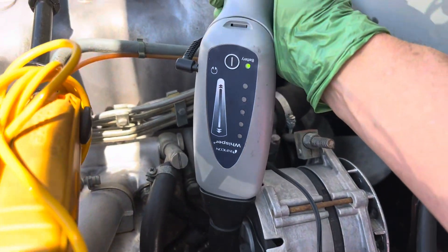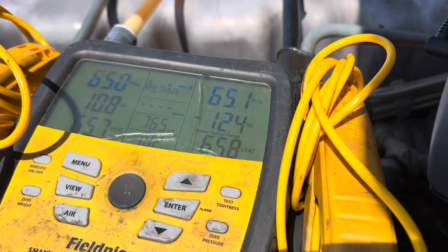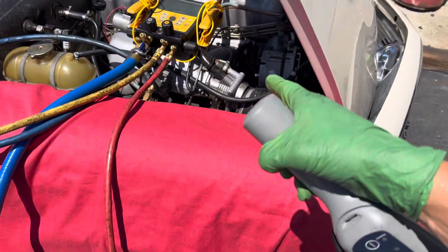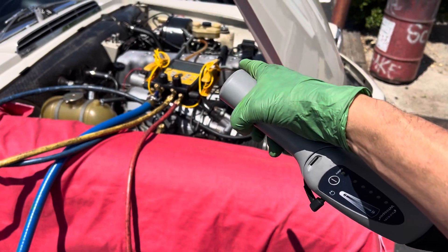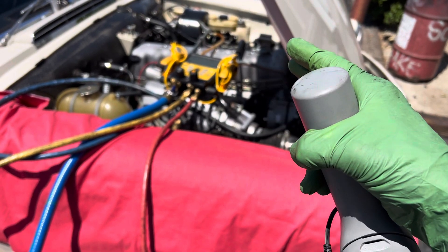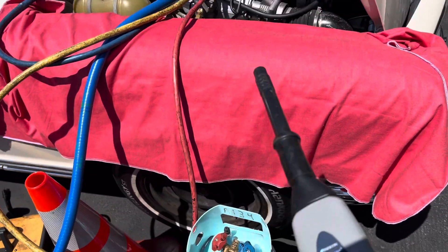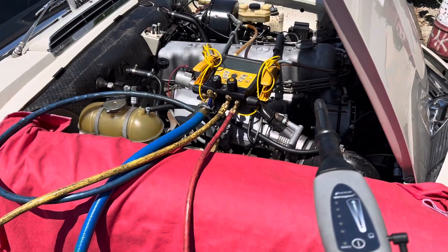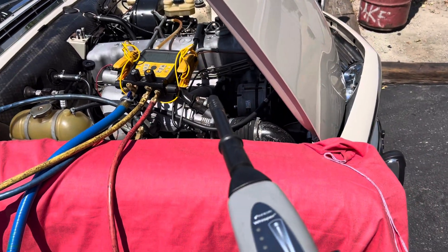As you can see with the whisper, there is nothing at 65 psi — it's not leaking. When I got the pressure up to 200-something it was leaking, and as the pressure was bleeding out under the nitrogen and starting to approach 150 it was slowing down a lot. By the time I came back off video and disconnected it, the leak had stopped somewhere around 120 or 125 psi.